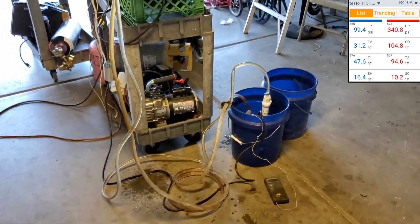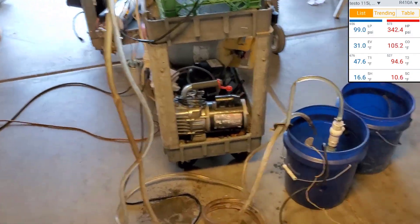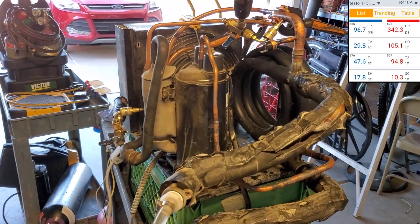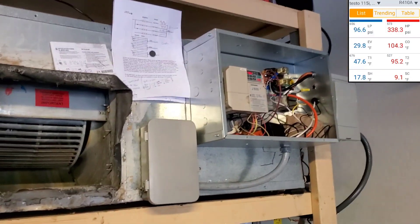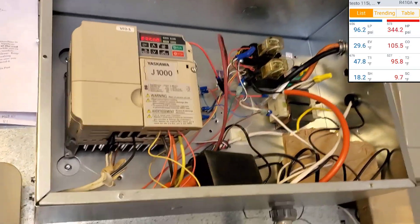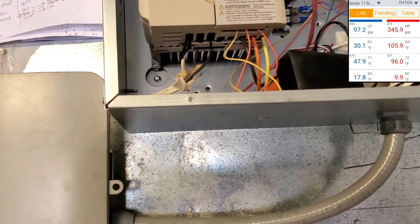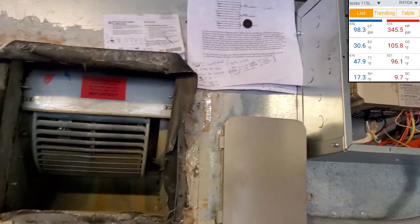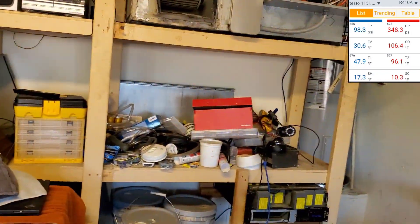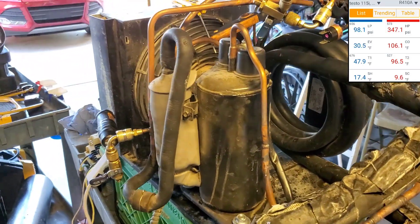It isn't like we'll be out of hot water because all I ever have to do is just hook up that element. But this would be another experiment. Maybe it'll heat up just fine because this is a 2-ton compressor in here, but I don't run it at 60 Hz — I'm running it quite a ways under. It does have a lot bigger coil, it is a 3-ton coil, but I'm running the blower real slow. So that thing never dripped any condensate water out of it, by the way. Never filled the trap, never dripped any water.